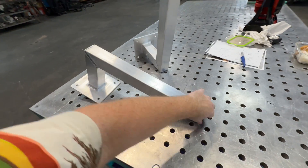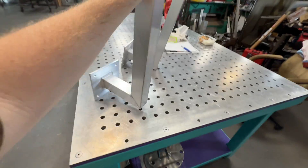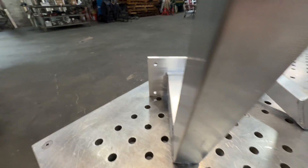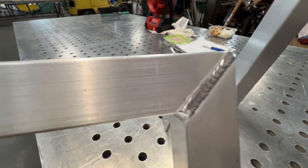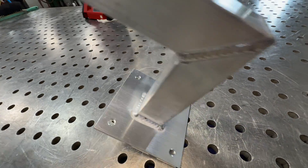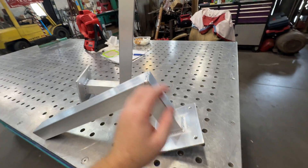That's one way of doing it — there are plenty of different other ways. We're going to put a cap on this and they'll install it into a wall — one will go like that and they can just hang their stuff on it. Hopefully you guys enjoyed it. The welds have a little dirtiness to them — that was from not wire brushing even though I cleaned it. Still hot and warm, not the best, not the worst. Easy cuts — just 45s, cut to length, drill your holes, and that's it.